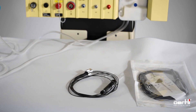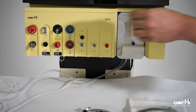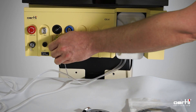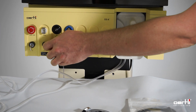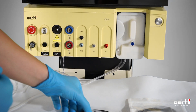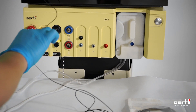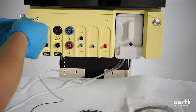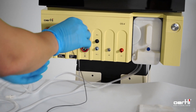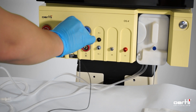Ask your jumper to remove the cover from the laser port and also from the LED port. Grab the connector and ensure that the fiber can move freely. Then connect carefully the plug with its connector. Ensure to screw it down all the way and make it tight.